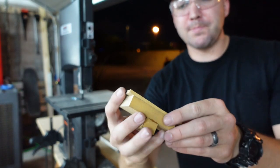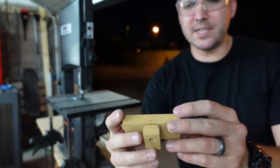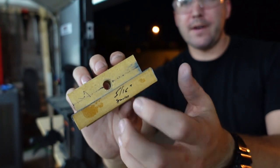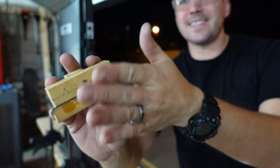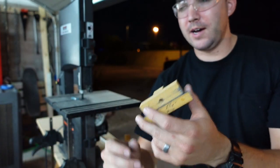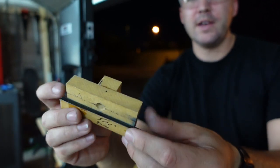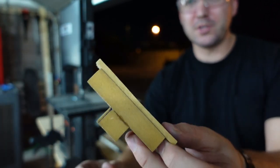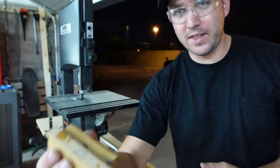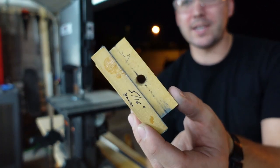So I made this block back on the tail cone, because that one had a lot of J-stiffeners that needed a 5/16-inch line inside the J-stiffener down the length of it for lining up with holes to later match drill. I made this block out of pretty good MDF. I already marked out one J-stiffener just now just to verify things are still centered and running perfectly — which they are. That's what I'll be using here.